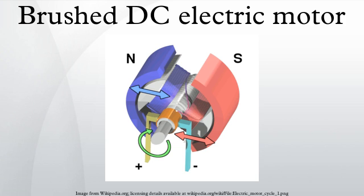Axial field motors. Traditionally, a field has been applied radially in and away from the rotation axis of the motor. However, some designs have the field flowing along the axis of the motor, with the rotor cutting the field lines as it rotates. This allows for much stronger magnetic fields, particularly if Halbach arrays are employed. This, in turn, gives more power to the motor at lower speeds.